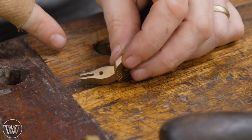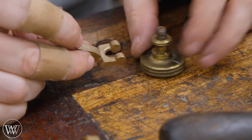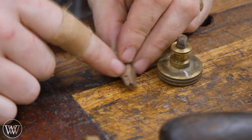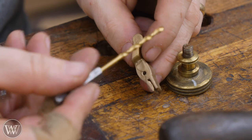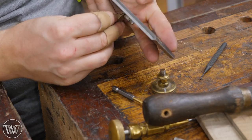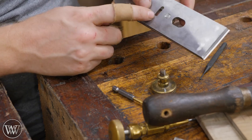With the split yoke, everything is basically the same. Fitting it in is going to take the same amount of filing or crushing down to make it fit a little better. When it comes to drilling out the hole, this hole is actually really close — on one of them the pin slid all the way through and on the other I just need to do a little bit of work. On this one the hole is a bit small and I have to drill it out, but it's already pre-drilled so I can grab a drill and an auger and just run this through for a nice clean fit. The nice thing about this style is it allows you to expand the head so it grabs the chip breaker much tighter.